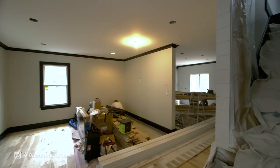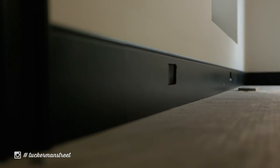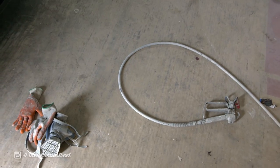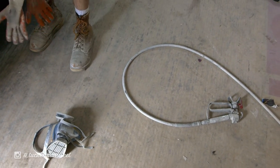The first step we do on any job is we protect the site. We like to cover the floors with a woven building paper so none of the paint, solvents, or anything gets through and it protects the floors really well. We also mask all the windows — anything that could get damaged we cover, so when we're out of here everything is good to go.